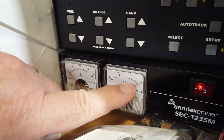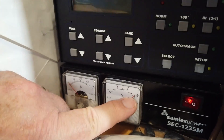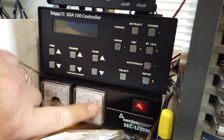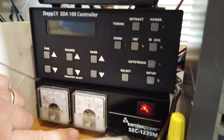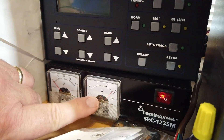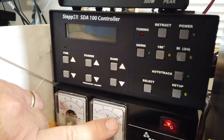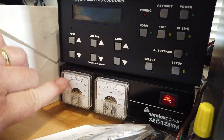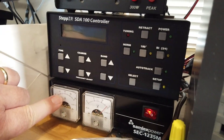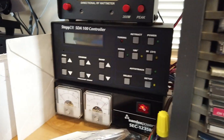We see this one over here shows that it's about 13.8 or 14 volts. Now, if you were to electrically charge the front of this thing, what would that do to the meter? Well, the meter works on a magnetic basis. But the electrostatic charge will tend to pull the needle out toward the face. There's very little room in here, and you can pull it out to the point where it won't be able to move past where the static charge is, and you'll get wildly inaccurate readings.